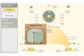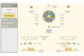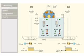Check the hydraulic oil level in the tank. Insufficient hydraulic oil level will lead to poor performance of the system. However, alarms are provided to warn the operator. Check whether power supply is available for both the steering motors. Standby steering motor power supply should be available for emergencies.